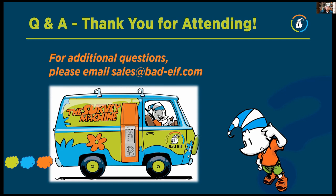This was just with one Bad Elf Flex in the extreme accuracy mode, receiving RTK corrections via NTRIP. Let's see here. We've got, is the monthly subscription required in addition to the tokens to access the higher RTK accuracy? That's a great question. So we have a couple different ways you can do this. You can have the Bad Elf Flex standard, right? And so that's that 30 to 60 centimeter accuracy.